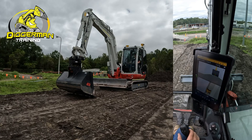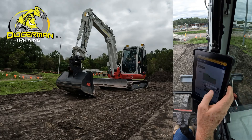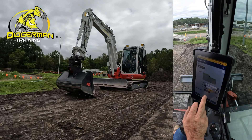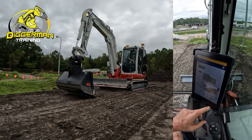At the moment it's roughly at about 250 below finish level. I'm just going to punch in 270 below finish level so we can trim a bit off it. You just select on that and punch in minus 0.270, then hit apply.